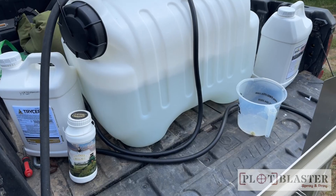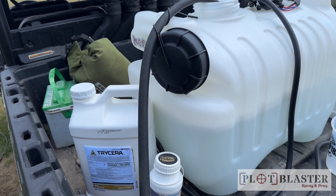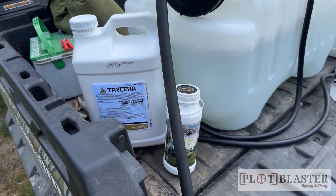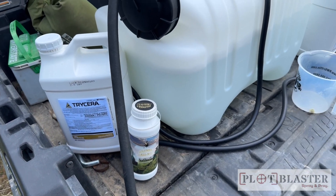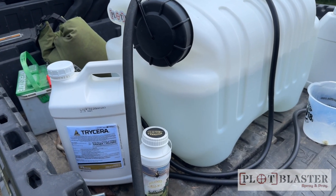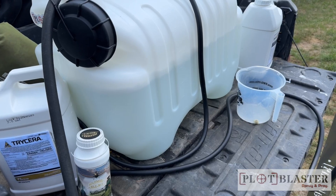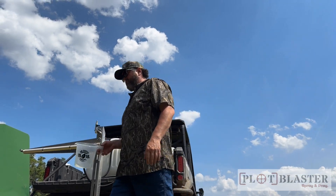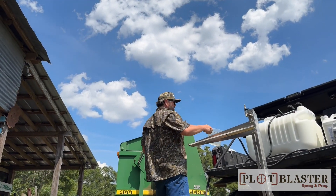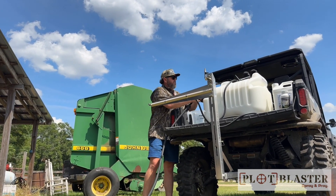One other thing to mention when you're mixing your tank and getting ready to get started: I like to go ahead and get my tank about half full, and then add my Solumax 5. It has a pH conditioner in it, so it goes ahead and gets the water ready before you start adding your herbicides — gets the water where it accepts it better and breaks it down as it should be. Once you've got everything in, go ahead and give your mixing cup a good triple rinse, and that'll keep things from building up and causing problems later.